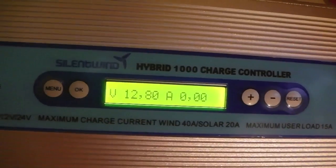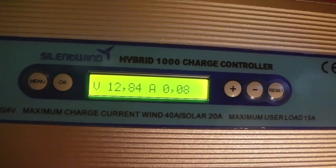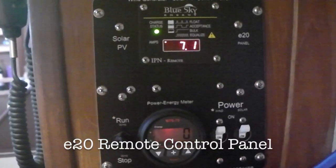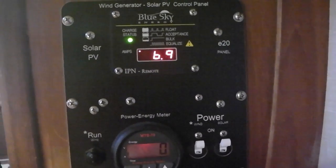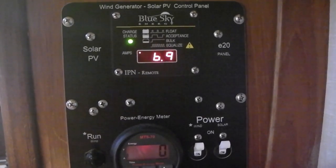I'm in the back of our quarter berth. The wires come in through the transom of the boat, through the starboard lazarette, and then they come out here. Here is the charge controller — sort of like a regulator for our Silent Wind wind generator. The 12.8 is our battery bank, and the other number you see is how much wind we're generating right now — we're not generating anything. This is the E20 controller; it monitors both our wind and our solar. You can see the 7.1 — that is the amps we're getting out of the solar panels right now. The 13-point-whatever is our battery bank registering high because we're charging right now.